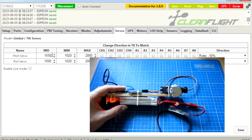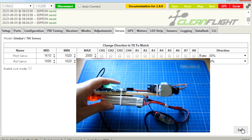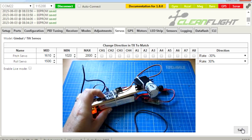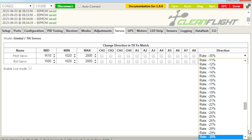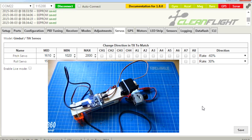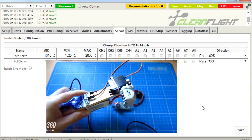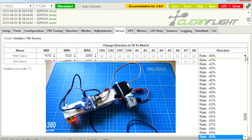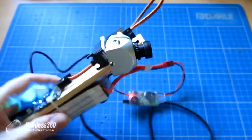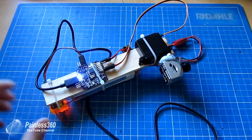That moved it, and it probably needs a bit more — maybe another 40. That's very close, probably another 30. That's better — the camera looks more like it's flat. As I'm moving the gimbal around, it isn't quite going far enough. So we need to increase that rate number — it's minus 30 at the moment. Let's double it to about minus 60 and click save. That's looking a lot better — it's probably overshooting very slightly now. I'd drop that to maybe 50. This is the iterative part. That's pretty much spot on — it might be a couple away from perfect. So now we have a very simple single servo stabilising a camera on the NAZE32.